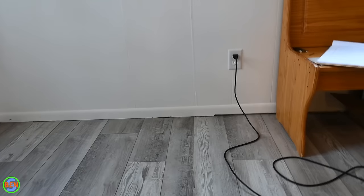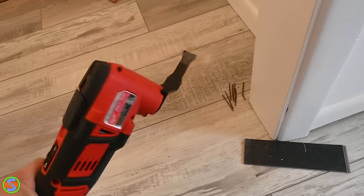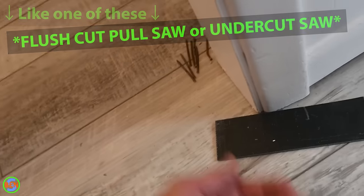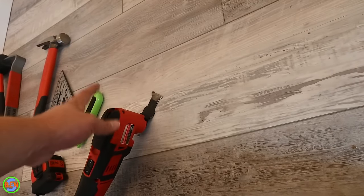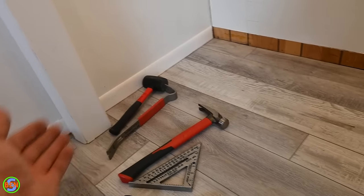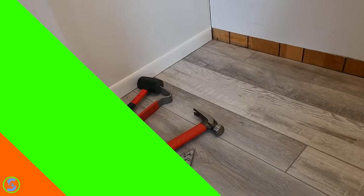You can do it without an oscillating tool by using a coping saw, but the oscillating tool is much better for getting into corners and undercutting trim in tight locations where a hand saw can't reach. Use the oscillating tool for trim and the coping saw only for straightforward doorway cuts.